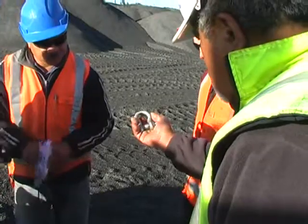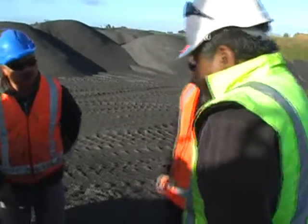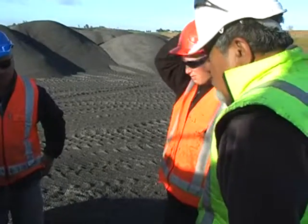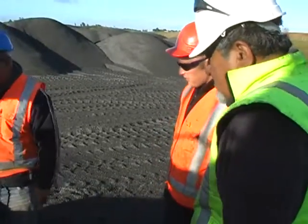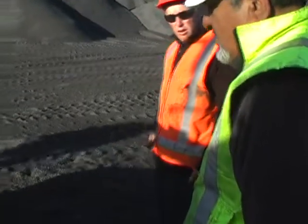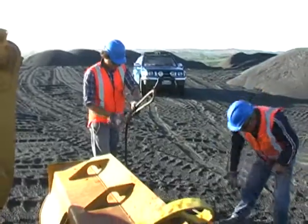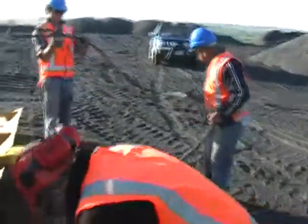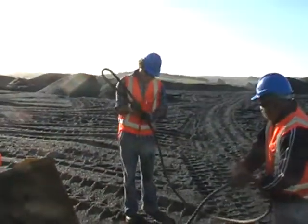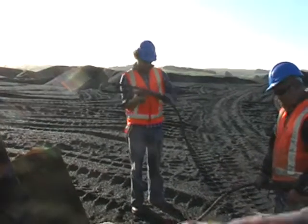All right. So failing that, if your strops aren't capable of doing the task, what other thing can we use? As you can see down there, wire rope. When you inspect the wire rope, what are you looking at? The rated pull on it, which looks like 40 ton on this one. Yep, 40. Okay, put that down, Chris.